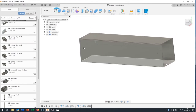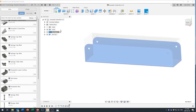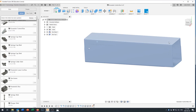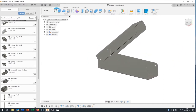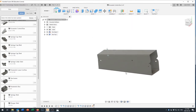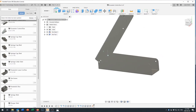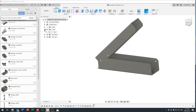Turn all components back on, pick up the top part, and you can drag it up and down to see the range of movement. If you were really concerned about it rotating too far in either direction, you could come back and edit the joint limits by right-clicking the Revolute joint. But we'll let the syringe's own travel limits take care of that.